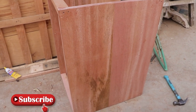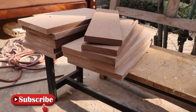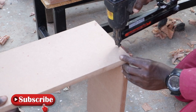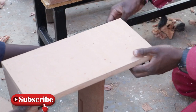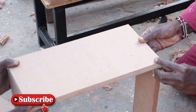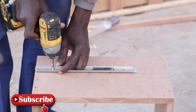Once done with the drawer boxes, we went ahead to create the drawers, and we did this by cutting all our drawer sides on the table saw. We then attached all these pieces using wood glue and nails. We then attached the rails and dry fitted our drawers on the drawer box.